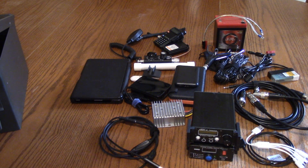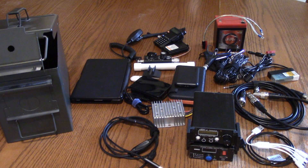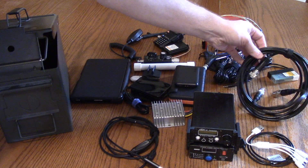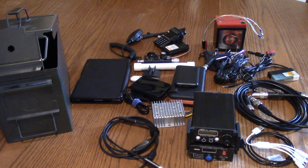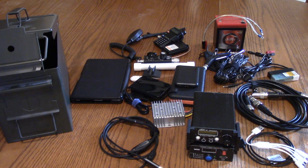With all this gear, I actually took this out to the park the other day. With this collection of stuff that fits in the ammo can, you can run JS-8 Call all day long remotely. The nice thing about this setup is you set up your antenna wherever it's easy to set up. With this short bit of coax, I didn't need to run coax all the way to where I was going to sit and operate — I had my radio and gear and antenna all there in the bushes by the tree. Then I sat at a distance and connected remotely directly to the Raspberry Pi from the tablet, so the radio could run continuously and I just connected when I needed it. That's what you can fit in an ammo can very easily with extra space: a full HF station with JS-8 Call and VHF as well.